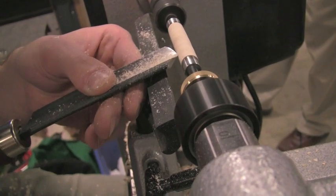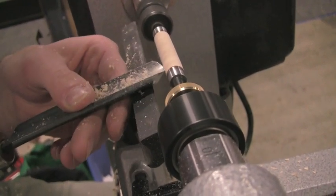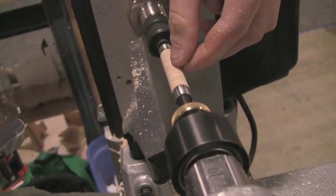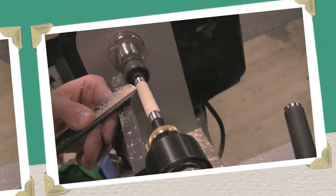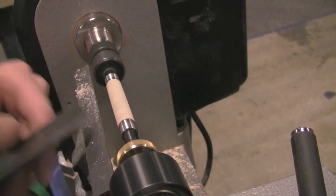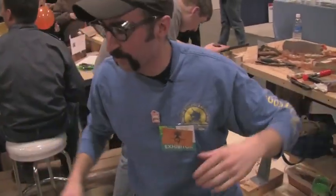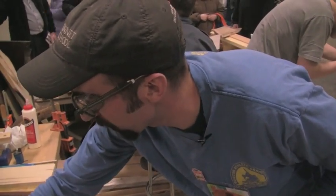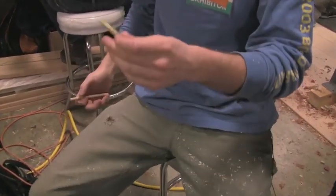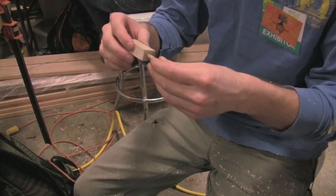You can even put a straight edge on there — a four-inch Starrett ruler — to test flatness. The real time saver is roughing out quickly to get to the fine work stage. One thing I forgot to mention: when gluing the brass tube in, super glue — even without an accelerator — dries pretty quickly. When you're putting this in, you have a little bit of time, but you don't want to dilly-dally because I've had a lot of them just get stuck.